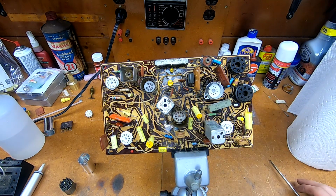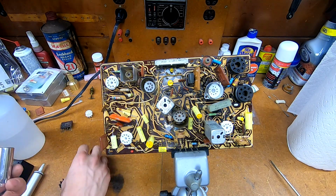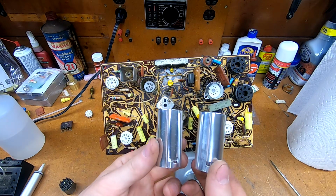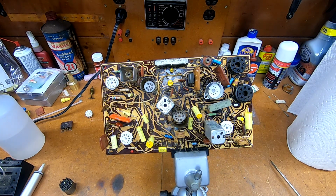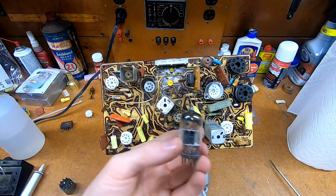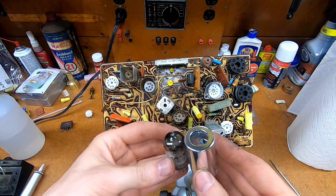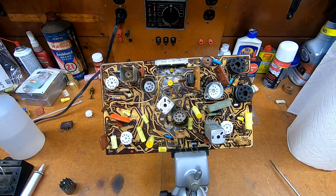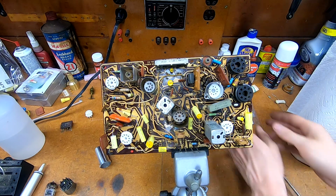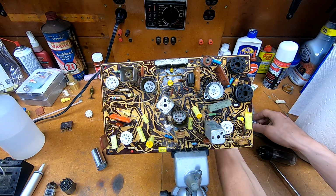So that portion is shielded, but I ran into a slight snag because the original shield that comes with this, I did not realize, was really meant for tubes like a 12AU7. Relatively short stuff like, you know, like this. This is actually a 6B-K7A. That'll work fine with there. The little spring inside there won't have any issues. Unfortunately, the tube that actually goes in there is not the size of the 12AU7.